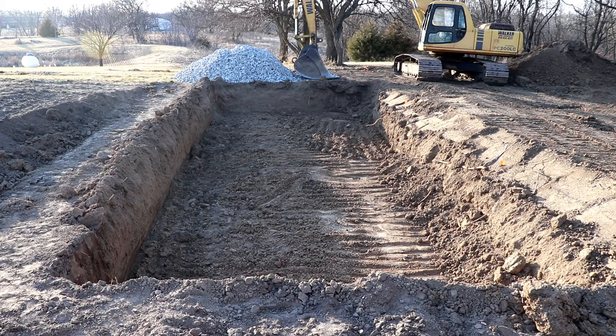After the rock is in, we have an exclusion barrier — it's a three-mil material that will allow water to pass but will not allow soil to pass. If soil gets down into the rock, it will plug the rock and plug our heat sink, and it won't work anymore. Day one is done, and I hope to have more to show you tomorrow as we start filling this back in. I'll set up a camera here on top of this mound of dirt so you'll get to see the process — I'll record a good part of it, speed it up, and stop every once in a while to explain what we're doing. Thanks for watching!